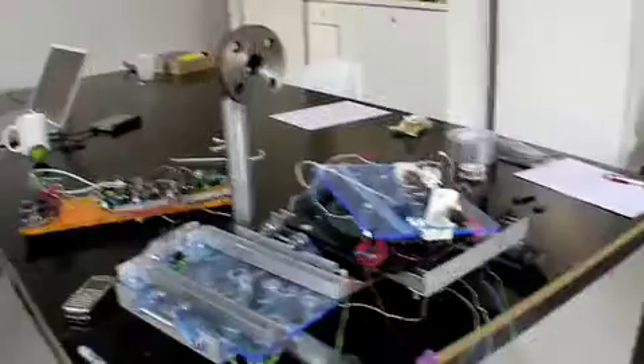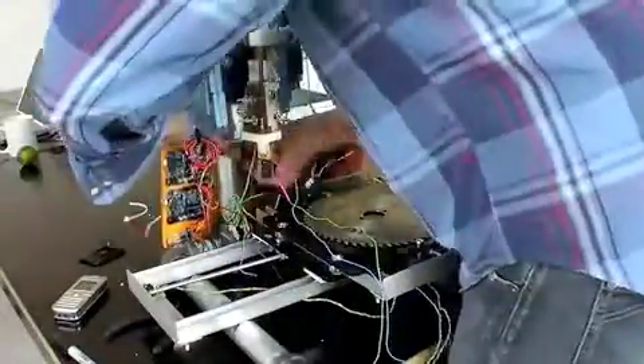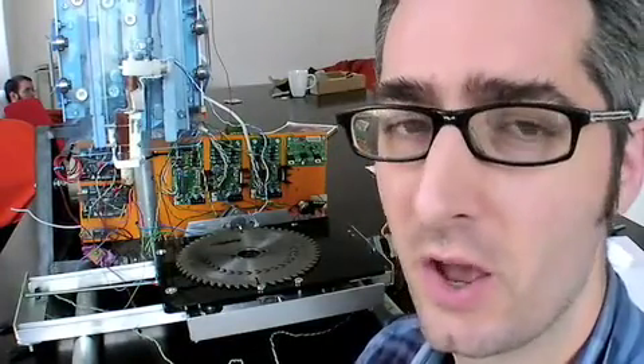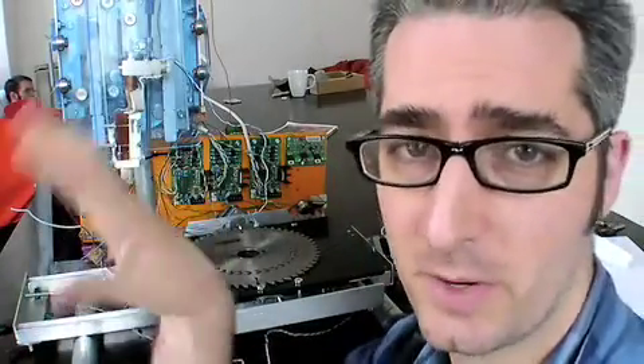Let's put this thing back together. We had some issues with the electronics when we plugged it in — we blew a motor board and I think we had some grounding issues. Also remember to make the wires and connectors just exactly long enough; if you have too many wires going everywhere you can get some RF interference.